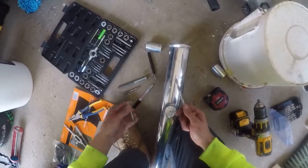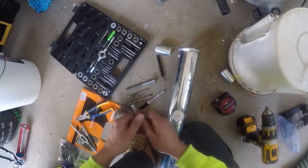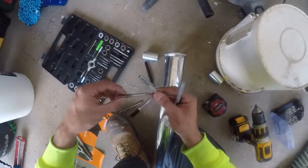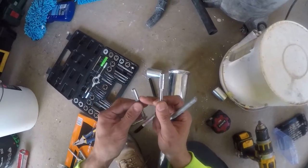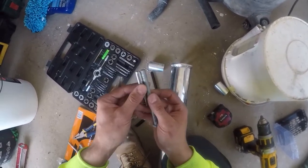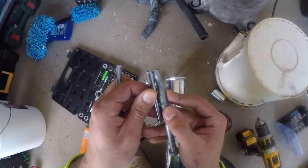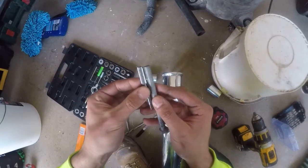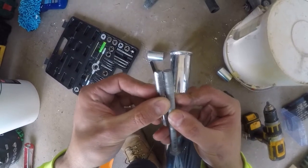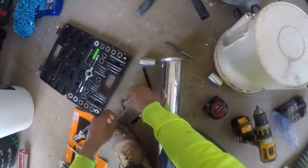Once your pilot hole is drilled, you need to work out what size drill bit you need to fit your thread through. There's a table you can download online — I'll put it in the description below. I'm using an M10 bolt, so I need an M10 tap. These two are both M10s — one's a fine thread and one's a coarse thread. You can tell which one you need by lining it up against your bolt. If there's a clearance gap between the teeth, that's the fine thread. The coarse thread will match up perfectly with no gap, and that's what we'll be using.